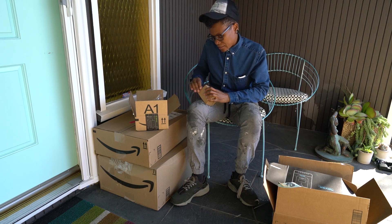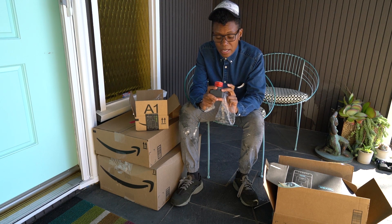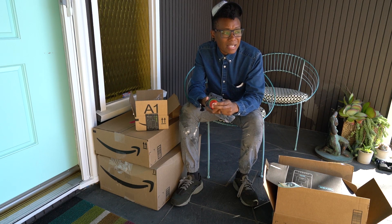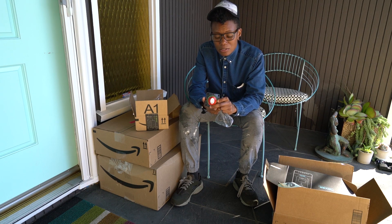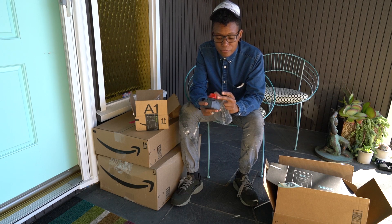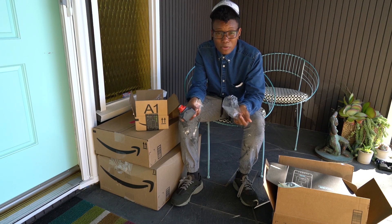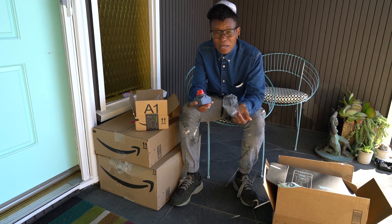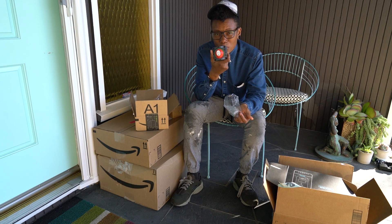This guy is my battery disconnect — it's my manual switch to disconnect my battery. This is going to come in handy when I'm on the grid, because my system is going to be hybrid. I'll be able to plug Shadow in and run off of grid power and also be able to run off my solar. When I'm plugged into the grid, I can switch this from on to off and it will disconnect the battery. I think the way it would work is: I turn this off, it disconnects my battery, and then I turn my inverter off, and the power being fed into my DC and AC breaker box will come from the grid. So that's my manual battery disconnect.